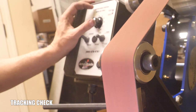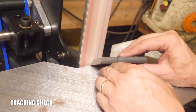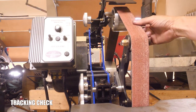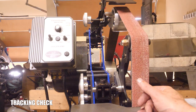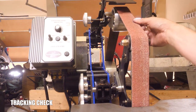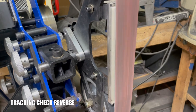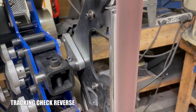Let's crank it up and see what happens. One of the things I'm already noticing is how dead-on this tracking is — it's really amazing, just rock solid. It doesn't drift with pressure, it doesn't wobble. My last belt grinder, you couldn't adjust the platen wheels in and out and it wasn't nearly as stable. I let the crown on the tracking wheel wear down over six or seven years, so that could have been replaced, but even in its heyday it wasn't like this — this just runs dead straight. Except when you go from forward to reverse; you have to adjust the tracking wheel about half an inch or so. I'm not going to use reverse, and it's so dead-on going forward, I'm just going to leave things the way they are.